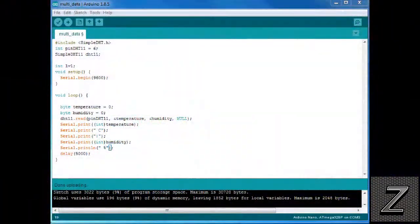I have the Arduino IDE opened up here. To start with, for using the DHT11 we're just including the library, setting what pin it's on, and starting serial begin — we'll move past that quickly. What we need to go over is how we are sending the multiple readings to the Android device, and then when we get to MIT App Inventor I'll show you how we pull it back apart.